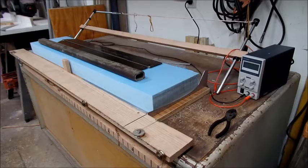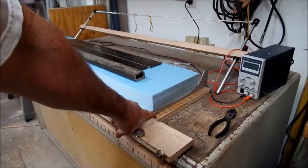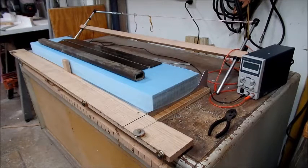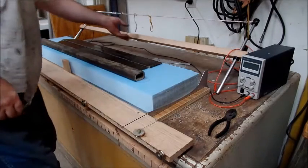Now we're ready to cut. Clamped in the jig is a piece of foam — three inches thick. It's extruded polystyrene XPS foam, specifically Dow High Load 60, which is designed for concrete applications under highways and airport runways — not your standard foam from Home Depot. It has 60 psi compressive strength. The aluminum templates are secured on the ends with sharpened finishing nails into the foam. The power supply is set at 4.5 amps and the pulling weight is about 9 to 10 ounces.